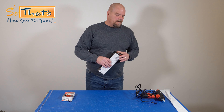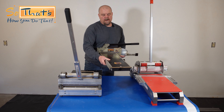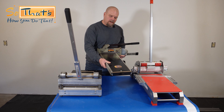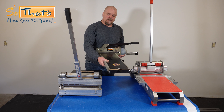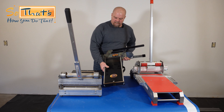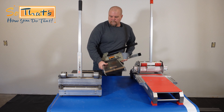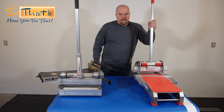This is the glue stick you need to use with this glue gun. You can't get these at Walmart or the big box stores — this is a specialty item. I'll have a link where you can get them; they usually don't run out of stock. It's called Flex 180. It sticks to concrete, plastic, and all different things — that's what makes it unique compared to craft glue sticks. If you have a concrete slab, this is really the way to go. Between this glue gun and these spacers, especially with a concrete slab, it's definitely the way to make your install a lot easier.